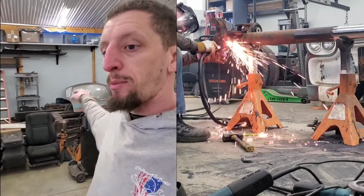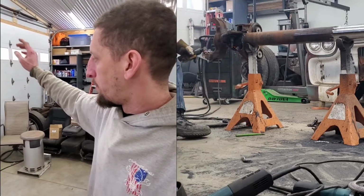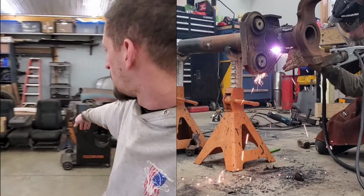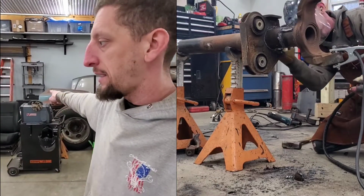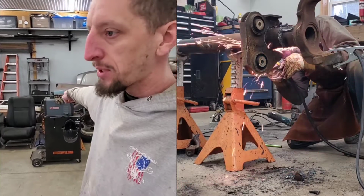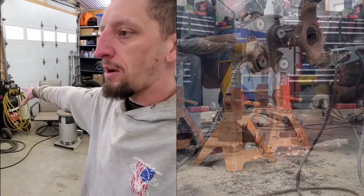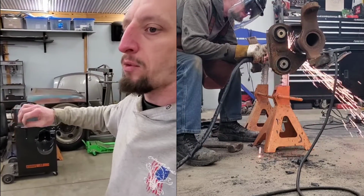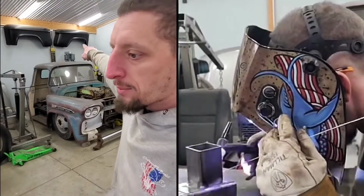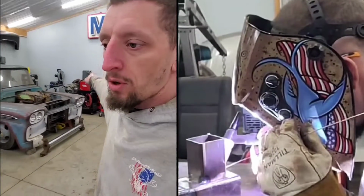I have all of those pieces of equipment set up to run 220 volts, so it lowers the amperage. The air compressor runs, I think, like 8 amps on 220 volt. My plasma cutter actually is the biggest piece of equipment. That will max out the generator at 50 amps. So I have to be careful when I'm using the plasma cutter along with the air compressor. I can do it, but I just have to be careful how thick of material I'm cutting. The mill is another 10 amps at 220 volt, and then my welder runs 30 amps.